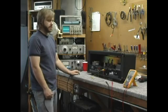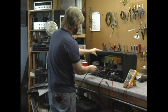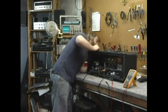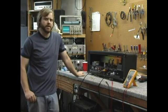Now that we have these pins properly connected, we're going to plug in the amp, plug in a speaker of proper impedance, turn on the amp and turn off standby. We must now wait a few minutes for the amp to warm up before we can test the bias.